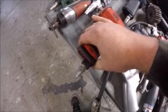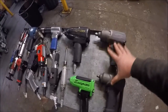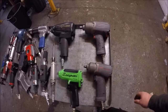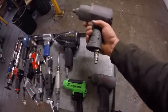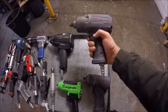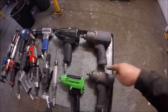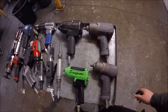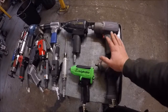When you pull the trigger, you have 90 PSI with the tool running. Generally that means you've got to set your regulator to - in my case - 118 PSI, so that when you pull the trigger it's 90 at the base of the tool. That's not at the regulator, that's at the base of the tool, trigger pulled, 90 PSI. If you have this with the high flow fittings, the IR wins every single day.